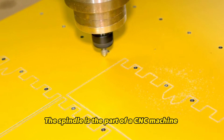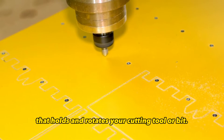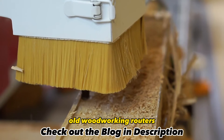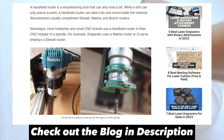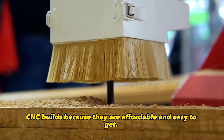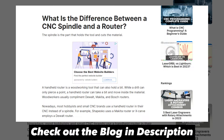The spindle is the part of a CNC machine that holds and rotates your cutting tool or bit. Many hobby CNC machines actually use regular woodworking routers from companies like Makita or DeWalt rather than a real spindle. These routers are super common among home and garage CNC builds because they are affordable and easy to get. But how exactly do they compare to a professional spindle? There are some key differences you need to understand.